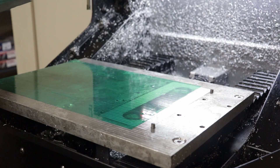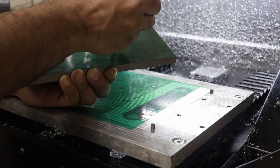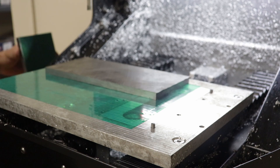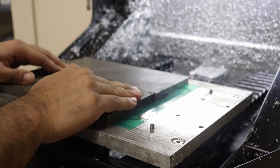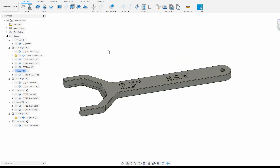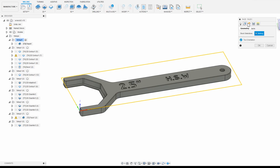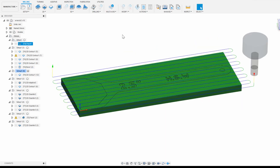Once the two tape surfaces are prepared, the next step is to apply superglue and quickly stick the part down and press for a few seconds. I'm doing both pieces of metal side by side at the same time. The first operation I'm doing on these wrenches is a facing operation with my 10mm insert mill. This tool is great for this type of application. I'm running at fairly heavy feeds and speeds that I figured out previously in my feeds and speeds video.